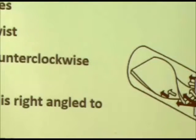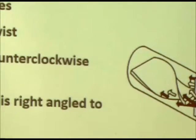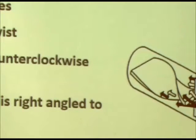So I'm going to talk about, first of all, the geometry. When we talk about mixing, there's a lot of ways you can mix stuff together. You can have an impeller attached to a motor, which mixes fluids together. Another perhaps impractical way to mix would be having a really, really long tube. Probably not the best way to go about doing something. The third way, and the way that we used here, was using a static mixer. A static mixer uses simple geometry. It's pretty much just a tube filled with elements that don't move, and you move fluid through the mixer, which ultimately causes mixing, and I will describe that in just a few minutes.